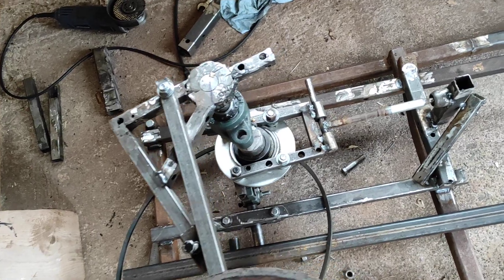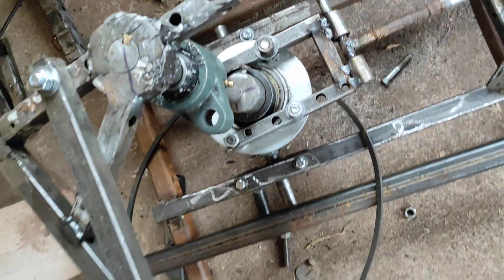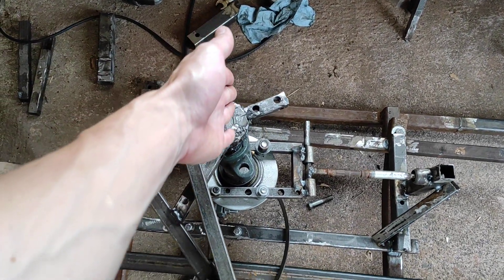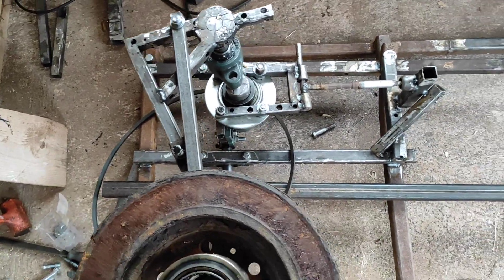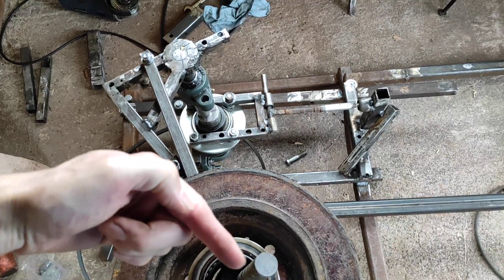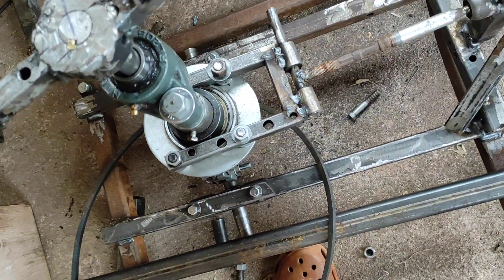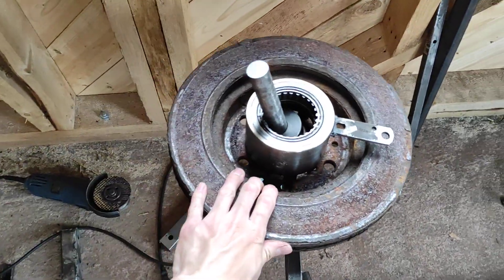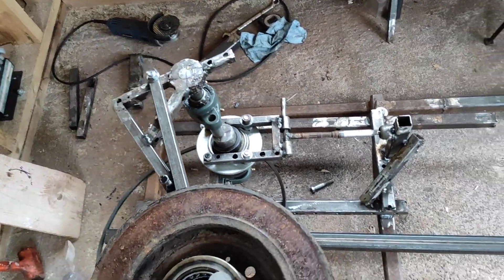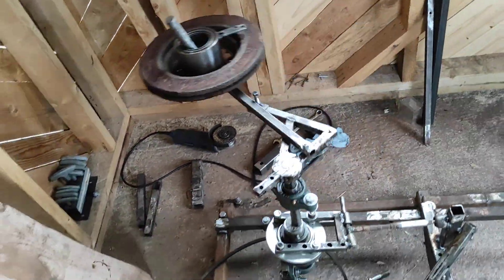You want to set it up so that — you see, I have a mark here — the widest part, and then 90 degrees. I have a T there, depending on which direction you spin it. This way is going counterclockwise, so this weight should line up here. As soon as this shaft starts going this way, the centrifugal force starts going in this direction. Over here, the shaft starts going this way, and the centrifugal force is that way. So the centrifugal force is actually pulling this shaft in whichever direction it's going. It's that simple.